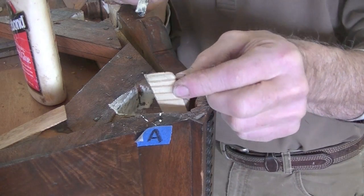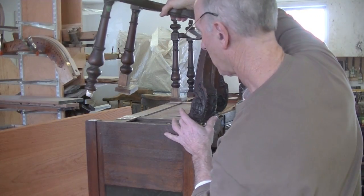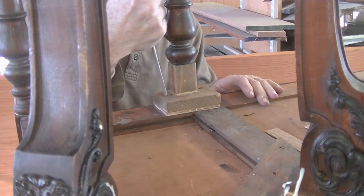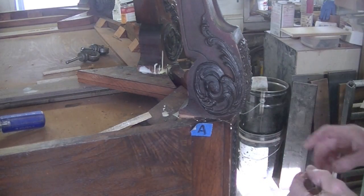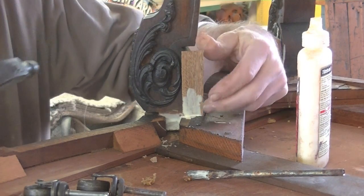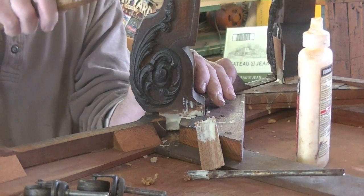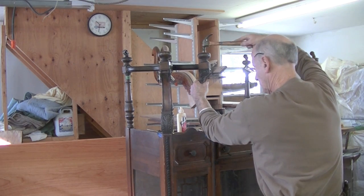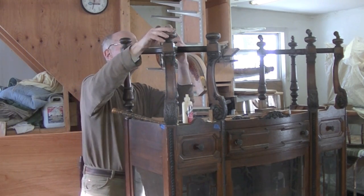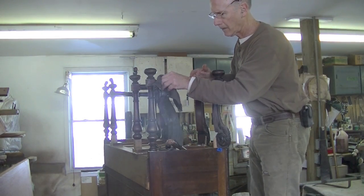These are some little wedges I made to fill where there was a chunk of wood missing on the tenon on the leg. I actually don't know if it was missing or never there. I had noticed during my dry glue-up there were gaps, so I want to fill those. I made these wedges on the stationary belt sander. This seems really solid — I don't think I need any clamps at all. I'll give my screws another tighten and I think that's good.